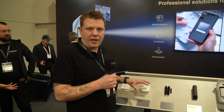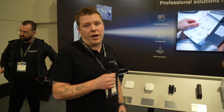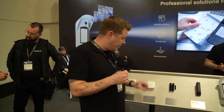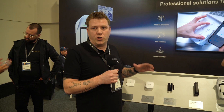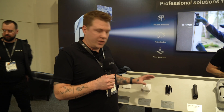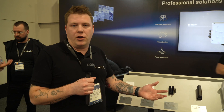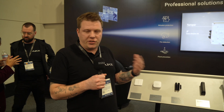All of the settings are completely customizable. You can set the temperature threshold, the humidity threshold, and the threshold for which the CO2 alerts you. You can actually leave it off-site, not connected to a hub at all — it's going to store three days' worth of data. Then you can bring it back to your hub, download that data, and go back to your customer to talk about their life quality, air quality, and the general quality within their building or their home.